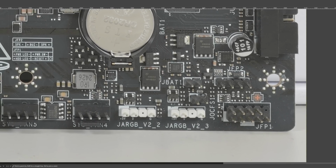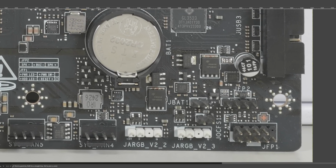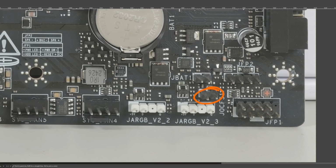So, in typical AM5 motherboard fashion, the safe boot function doesn't work. So that's not really that surprising, but it is a bit disappointing because if this did work, that would have been really, really cool. But as it is, it's the same as any other AM5 motherboard. It just doesn't do anything, or at least it doesn't do the thing you'd be hoping it does. Because the one thing it did actually do is drop the PCIe speed down to Gen 3, but that wasn't what I was hoping for. I wanted the memory overclock turned off. So yeah, it didn't do that.